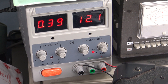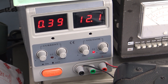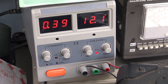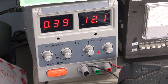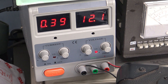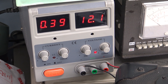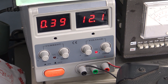On bench 4A in the back workshop, which Mr. Chippy mainly uses, is this power supply. This is where we'll be doing bleed-over tests for selectivity in future. I need to get my ham radio project off here to do that. Nearly all the power supplies here are 3A, because the only time we need a heftier supply is when doing 25W business radios — and those are done on bench 2, which is the one with the overhead camera. Everything else is never going to be more than 3A.